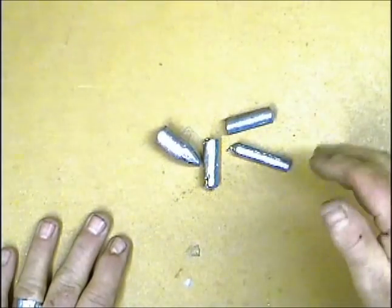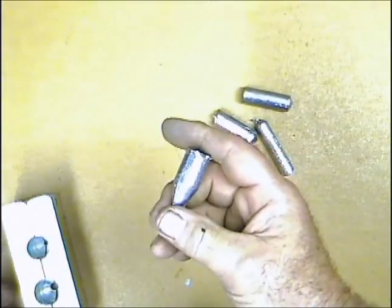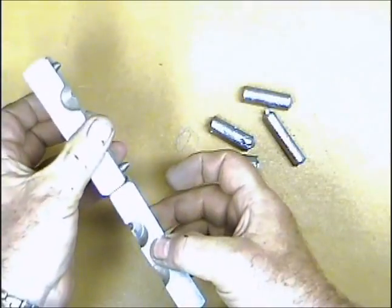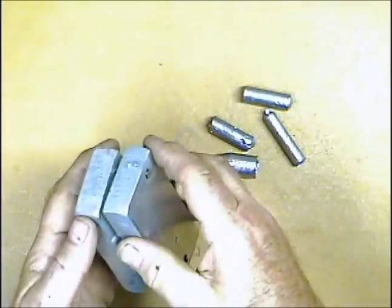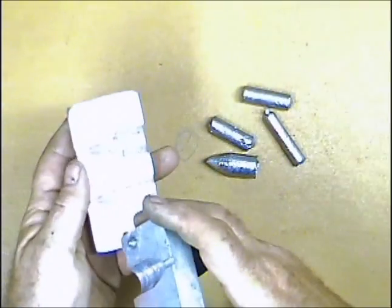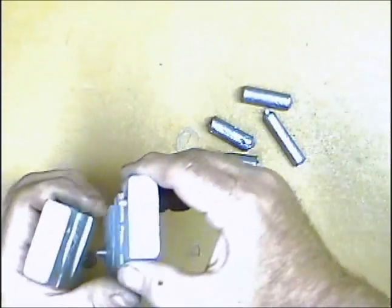Here are some different diameter lead weights. I make my own lead weight mold. It's easy to make. Start out with these bigger ones - I wanted a bigger heavier weight. The first thing you need is some aluminum. McMaster-Carr sells aluminum; you can buy a piece and cut it up, or go to a junkyard. I get two pieces of aluminum. The next hardest part is putting them together so they go to exactly the same spot. I use quarter-inch pins and rods for alignment.